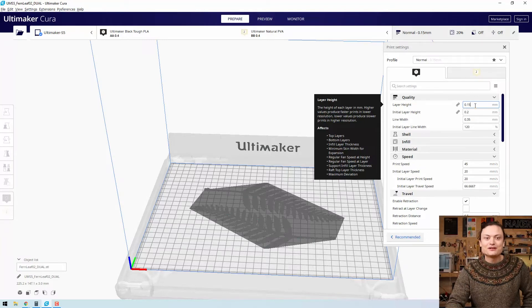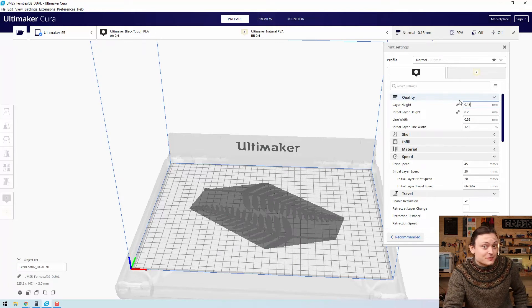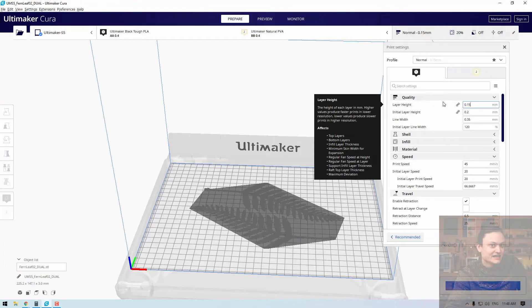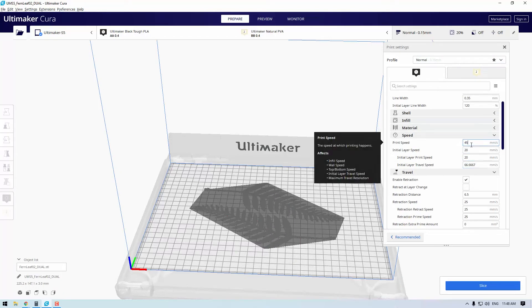Single layer prints are a lot of fun, particularly because of the speed it takes to produce them — each of these models took less than 20 minutes to make. Speed absolutely murders good single layer prints. If you're running into problems, another easy setting to alter is the initial layer print speed and initial layer travel speed. Jumping back into Cura, these two hidden settings can be found under the speed heading in the custom print settings menu. For first layer prints, 20 millimeters per second is an excellent speed for all of these settings. This will minimize vibrations and give the filament a better chance to extrude out reliably onto the build platform.